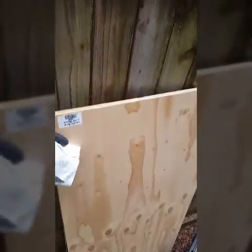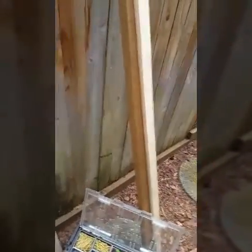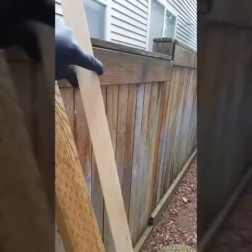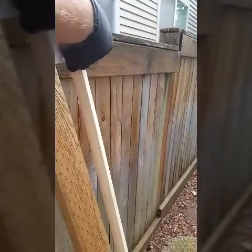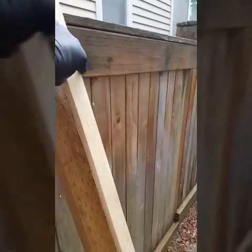Nice thick plywood. Some pressure treated 2x4, which becomes the frame that the door is going to be installed in. And then you want some 1 inch by 2 inch strip board. These are only like 89 cents. It's super cheap. And that's going to be inset on the frame that your door rests upon.